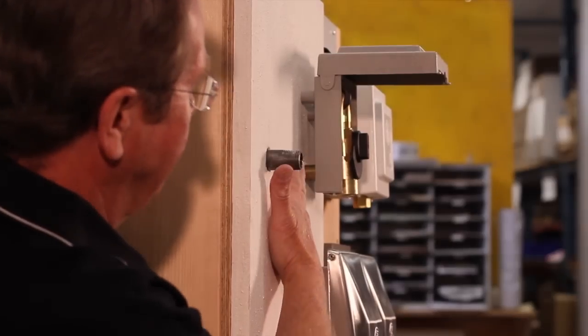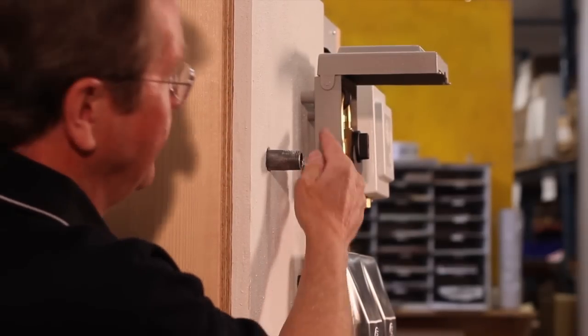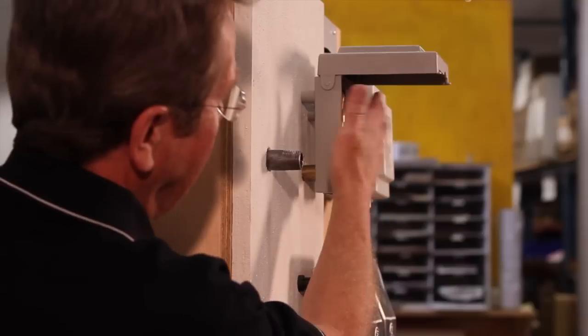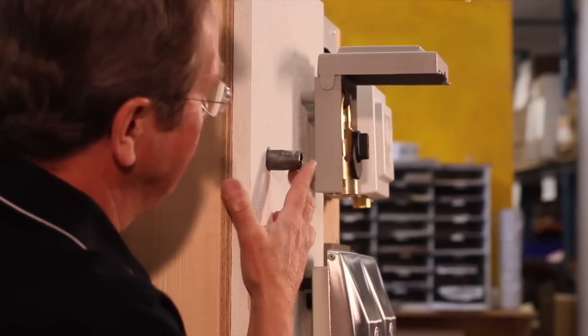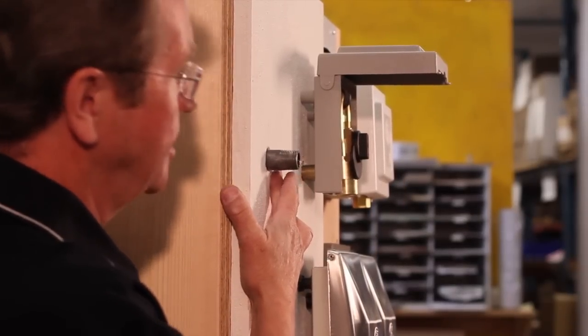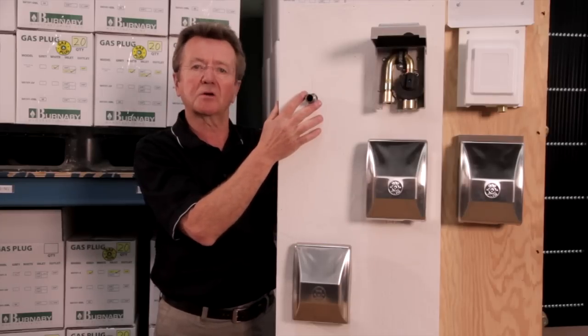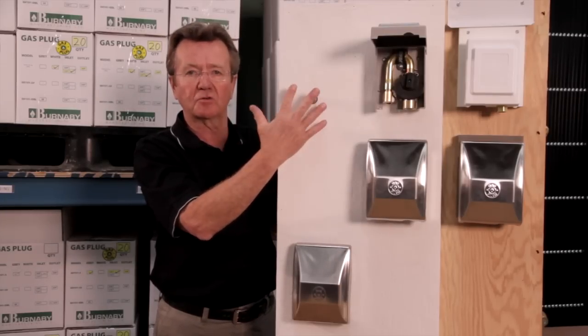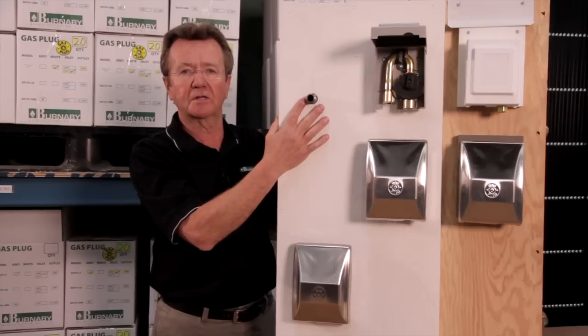Now this is a flat finish, so you didn't need it here, but if it was a siding finish, then you would use these standoffs. Again, making sure that this is flexible so it'll move. And if you need to secure that pipe according to codes, then go ahead and do that after your installation of the outside of the box. You can secure it on the inside.